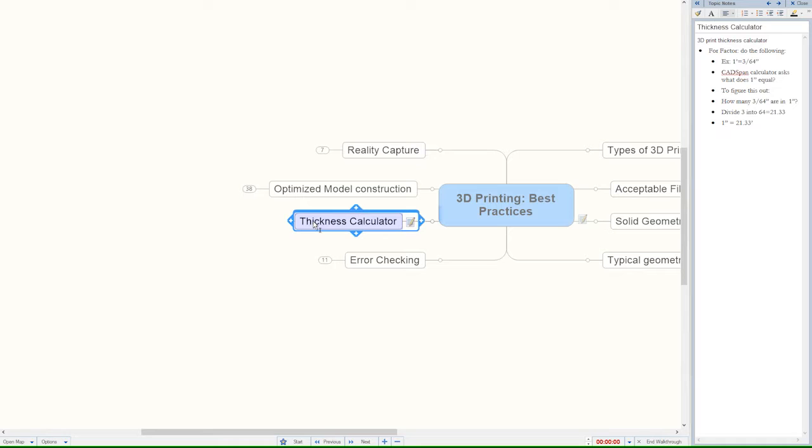So that structure will come over to the 3D printing software. It's fine in the real world because that's a piece of steel. But when you scale that down to 1/2 inch equals a foot, that piece of steel is paper thin. So we want to exaggerate certain things.